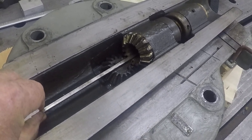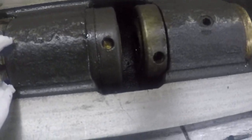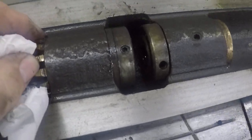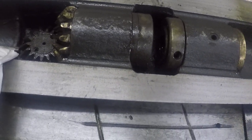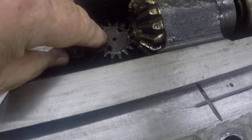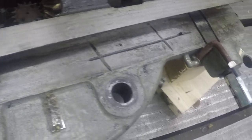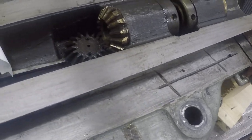I'm not really sure what that peg is for in there. This thing looks like it's missing one of the Allen set screws — both positions are at 90 degrees but that one's gone. To get in there and see what that post is, I'm going to have to take the Allen screws here, take that gear off, drop the shaft down to the other side, undo this last screw, and probably screw this off and push it out to be able to get in there and see what's going on.